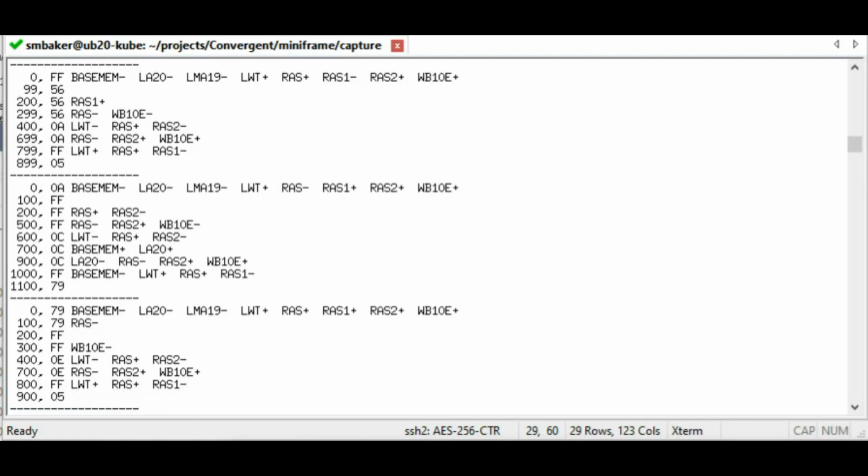Okay, I made many different passes with the logic analyzer looking at various lines as I slowly narrowed down to where this latest problem was. And this is the last pass I made. I wrote a little post-processor which takes the raw dump from the logic analyzer and outputs what's going on. In this column, you can see the bits that are on the data bus. So if 0A is there, then we were writing the 300A word. In previous iterations I had all of the bus arbitration out so you could look at it, but I only have 16 lines available on the logic analyzer, so I had to drop those.